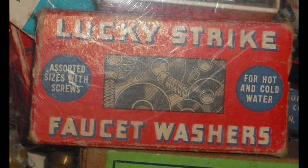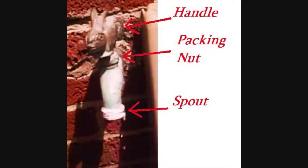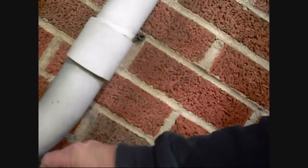Once you get the screw out, match up the washer and get another screw — it should be in the assorted pack of faucet washers and screws. Replace them and screw the new screw in. Take the stem and put it back into the faucet, screwing it righty. Gently screw it in by the handle and it'll screw right back down. Then screw on the packing nut and tighten it with the pliers, but don't go too far — tighten it enough.